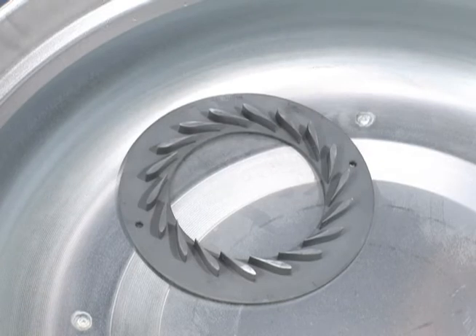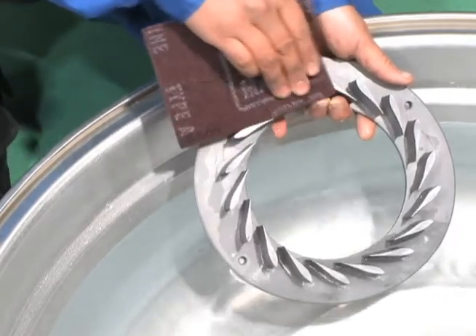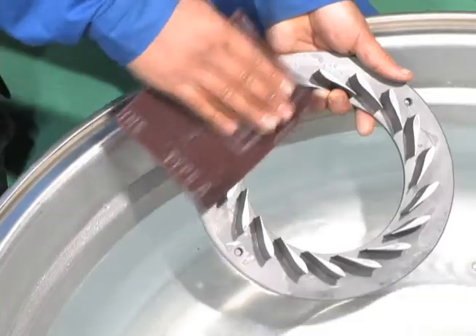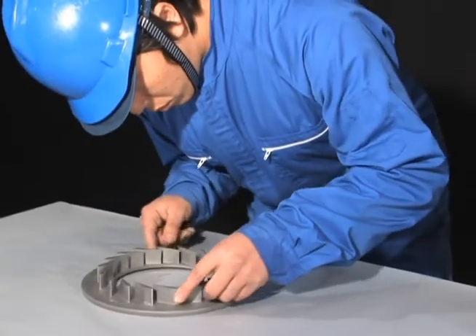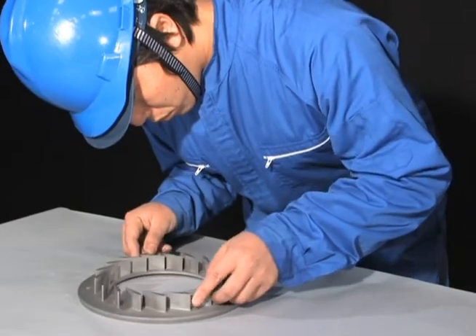Like the turbine wheel, clean the nozzle after washing in warm water. After cleaning the nozzle, dry it thoroughly and coat it with rust-proof oil. Visually inspect the nozzle in a well-lit location for abnormalities.